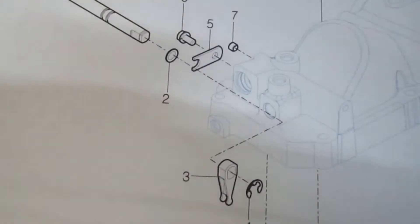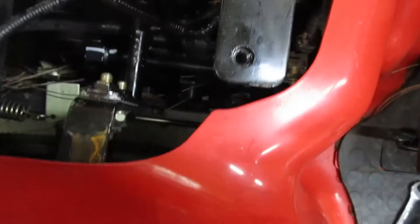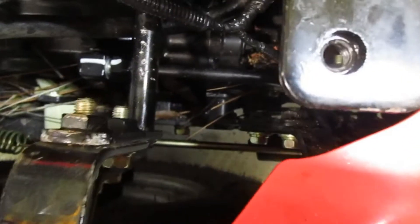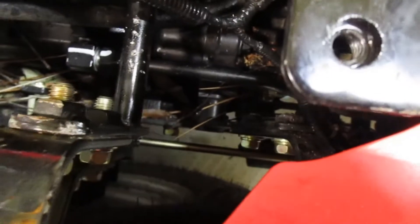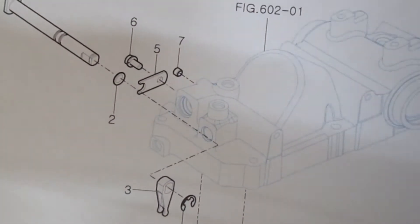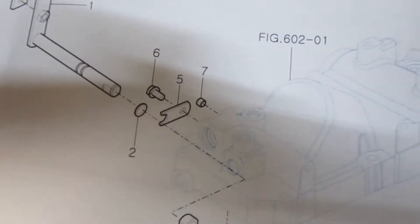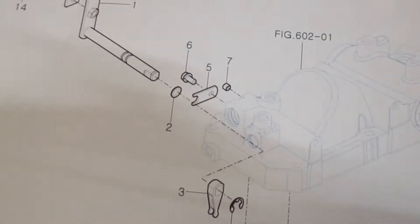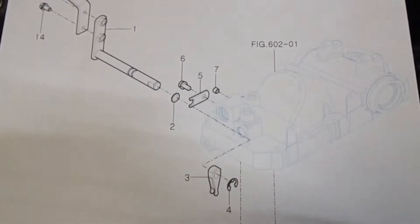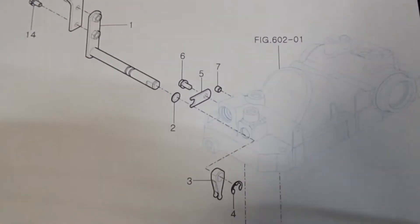The shaft is so stiff — it's just not moving at all. I'm also still having a problem with my four-wheel drive not going into two-wheel, but that might be something internal because I can hear clicking and there is a little bit of movement there. Before I tear this valve body apart, I'm going to put this plate back on loosely. I honestly don't remember if the selector moves with the tractor running or not, so I'm going to run the tractor.